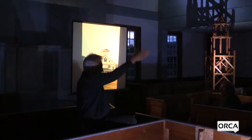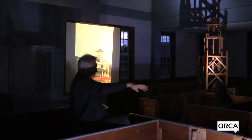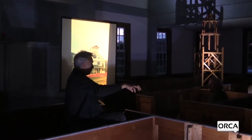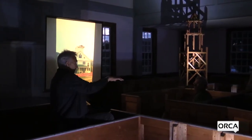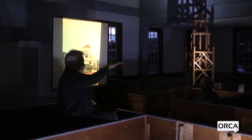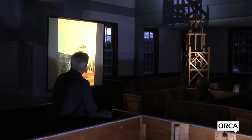It was wood, but when the water comes to a stop at a little skirting roof or an ornament where pigeons sit and poop, then you get terrible trouble. And all that area gets rotten. It rots the base of tall spires and cupolas. All these places down lower, where water comes to a stop and slows down, get in trouble.